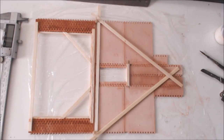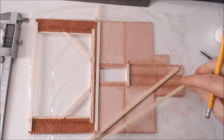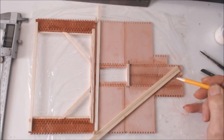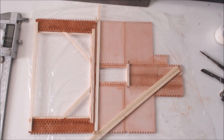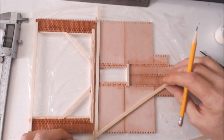This can be marked and cut off. Rather than doing a gable end where the tiles come over, I want the tiles to actually butt up to part of the wall so I can do some flashing, then a coping along the top of the wall. That's very easy to work out - put timber on top of timber, draw the mark all the way along, which gives the space for the timber and tiles, and this space allows for the flashing and coping so you don't see any edge of any tile.